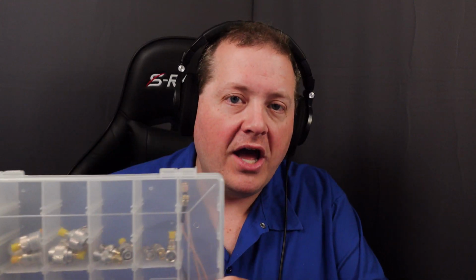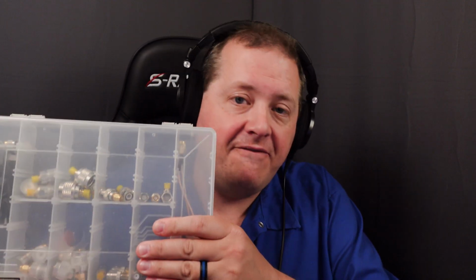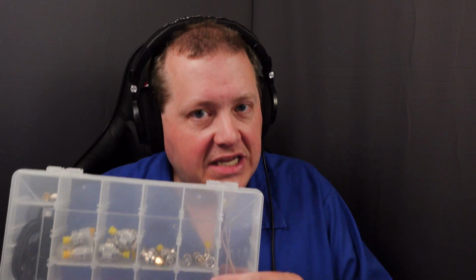It's very important that if you're going to use adapters in order to measure different types of connectors, that you have enough adapters. So I bought not just one, but 2 of the kits that you'll see down in the description below. I find it very important to carry multiples of them because if you just get one of them, it's going to have a reverse polarity on BNC. It's going to have a BNC male, BNC female, male and female on the SMA end, and you're only going to have one of them. So if you try to connect up both ends of your cable to the Nano VNA, you need to have an entire kit of 2 adapters per. So buy 2 of them, don't just buy one.